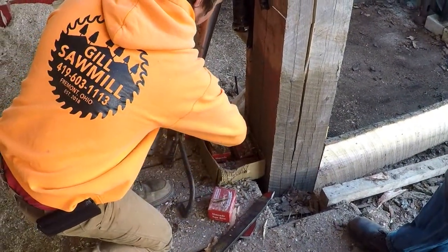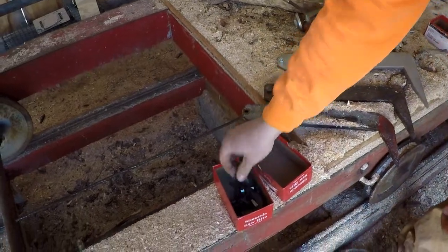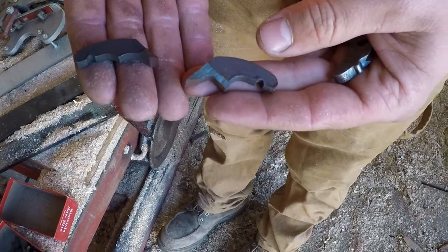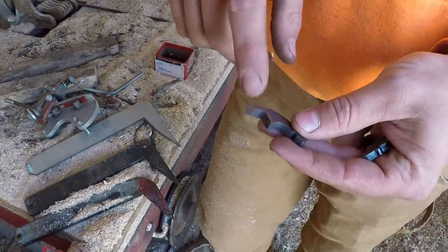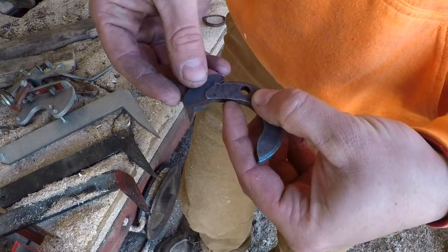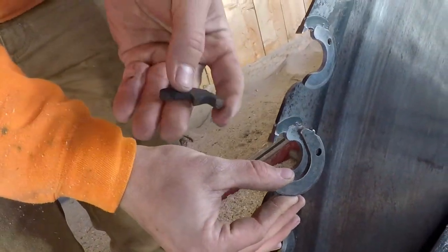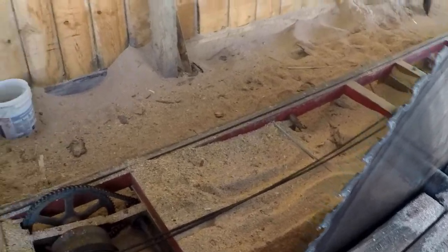I don't remember which one of these the shoulders is in. I think it's this one. Yep, so this is called a stand-all bit. It looks different than these regular bits. You can see the shape here. The difference is the regular bit is like a spring-fall bit, but when you're cutting frozen logs in the winter, the standall is supposed to get rid of the chips a little easier. So this slides into the saw, and this rides in here, and then the whole thing gets pinched in, as you can see here. Yep. So the tooth is replaceable and the shank is replaceable. Pretty slick.